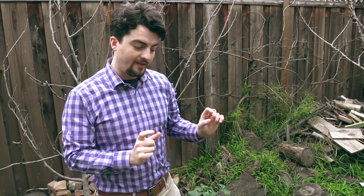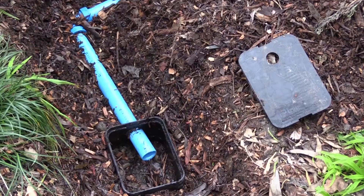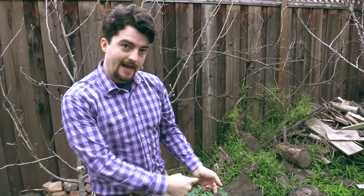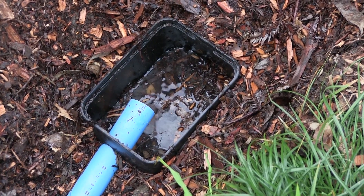It's extremely important to have the last valve box have an open pipe, because if any hair, lint, or other materials that could potentially clog your greywater system move out of your washer line, they have an exit route — since this last valve box has the same diameter as the washer line itself.